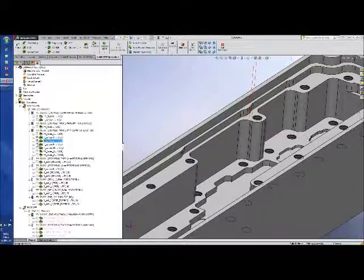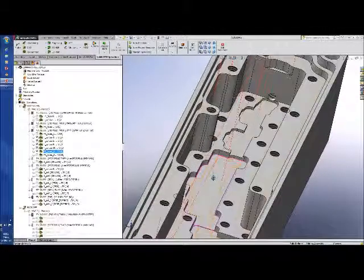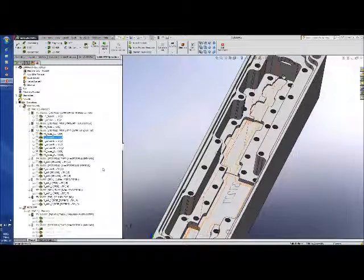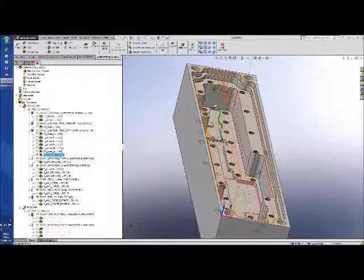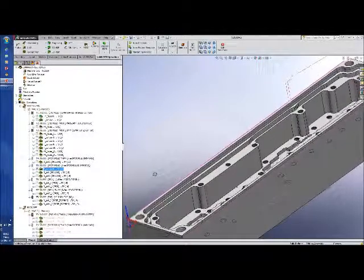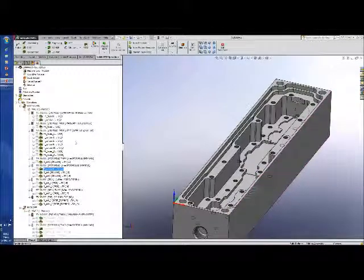Some profiling around to finish off the edges, again down to the same depth using the cutter. And finally a couple of pocket recognition operations down in the bottom just to take out the bottom pockets. Pocket recognition again being used to finish out. Then we go into the drilling — we're not going to be looking at the drilling, so I'm just going to skip over these. A contour is used to finish off the upper level with a 3mm tool. That's the basis of the part that has been sent in. Now let's have a look at the part we're going to do for the challenge.